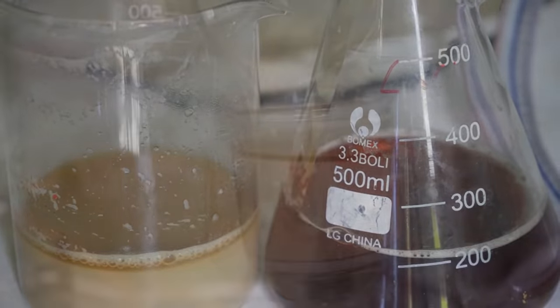But now we've selected the calcium, we get to dissolve everything back up because we want calcium chloride as the final product. And having calcium chloride lets us do one more calcium selection step, purification sort of thing later on, which we'll get to. For now, I want to put this all back into the solution, so I'm not going to dry it out now. Just going to add some hydrochloric slowly once again to not let it foam over. But we want to get all of this back into solution as calcium chloride.